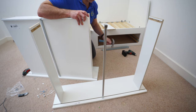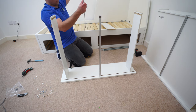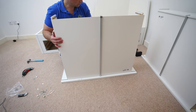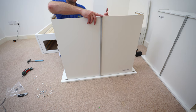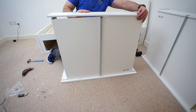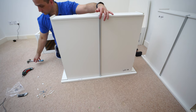With the supporting rail, on some drawers the hole is not pre-drilled, but in this case it is pre-drilled already. Exactly the same for the second drawer — we have the supporting rail in the middle, and the bottom panel comes nicely into the gap of the front panel. The back panel slides between the side panels. You can do the supporting rail after when you finish, but I'm placing it in now.